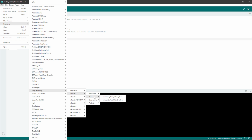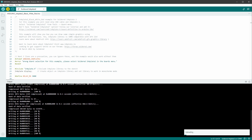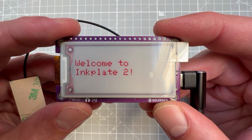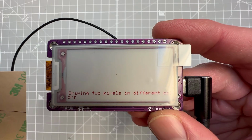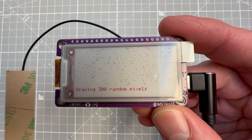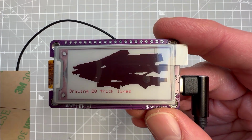But I will start with the basic one, being this black, white, red, and instead of looking at the code, let's upload it to the display and see what happens. Just click the upload button and wait a few seconds. And once this sketch is successfully compiled and uploaded, the screen again updates. It first shows the message "Welcome to Inkplate 2", and then it continues by drawing different pixels, lines, rectangles, triangles, circles, pretty much anything that you can think of. But of course it takes a lot of time because you cannot partially update the screen, and the screen update takes about 12 seconds. Unfortunately, the only thing that is not displayed in this demo is drawing the image, and that's the only thing that I actually need for my YouTube subscribers counter project.